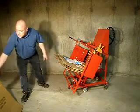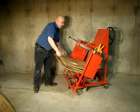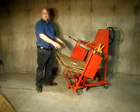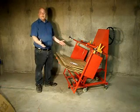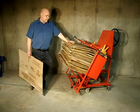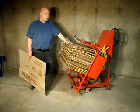And then you can grab bigger boxes and just pile them right on top. Basically what it does is with this, you'll be able to scrunch it up. It'll be part of the bale, and you won't have to dispose of them any other way. Now we've almost filled up the complete 20 inches. Basically, this will be between 40 and 50 pounds, not over 50 pounds.